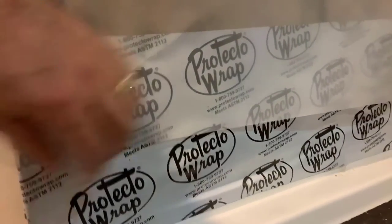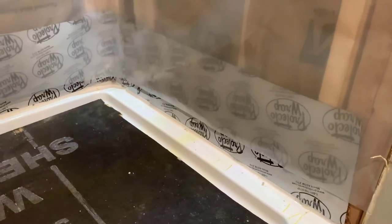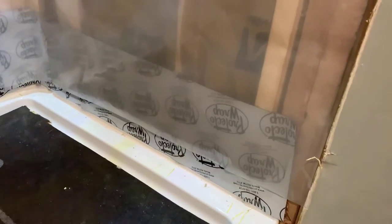I've now put the layer of plastic on - I went right about three feet up and all the way around. It got up a little bit higher on one side so I don't have the same overlap I wanted, but that's okay - it's still going to be well protected. Now I'm going to put my backer board on top of it, bring it down to about there, and attach it. That will give me my good water barrier and stop any water that leaches through the backer board - it'll just go straight down into the tub.